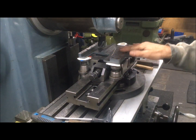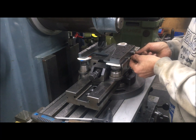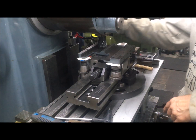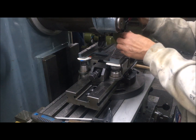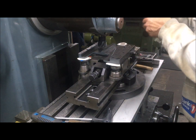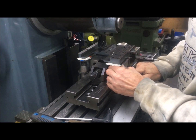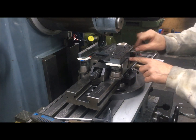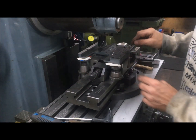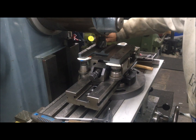This is my setup for milling the Super Seven saddle. Securely mounted it here and used some round bolts to hold it in the dovetails. I had to shim up a little bit here because I have of course measured down here and run an indicator along so I know that it's flat according to that. Using jacks here also to hold it. This end, which is secured here, is a pivoting point. To avoid that dipping down — meaning that this will be a little bit fat — I put screw jacks under there, and I will just mill here, keeping away from the rear side here because I know that it's virgin.